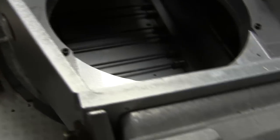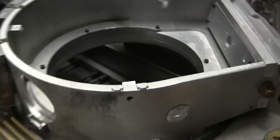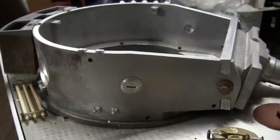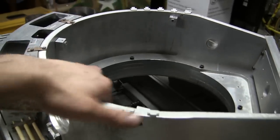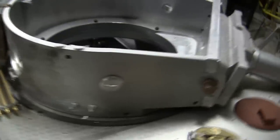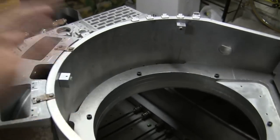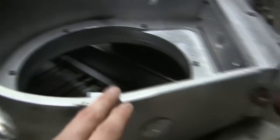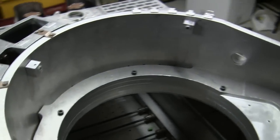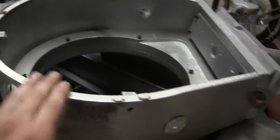Here is the interior of the turret with the top plate removed. The turret on this model is significantly different from their earlier first production Tiger I batches. The original Armortech Tiger I turret body was a solid piece of aluminum casting. This was later changed so that instead of a solid casting requiring more tooling and cost, they went with a bent aluminum plate design. The turret plate was first laser cut and then bent in a computerized bending machine — more realistic than the cast version, as the real German Tiger I turret was manufactured in a similar way.